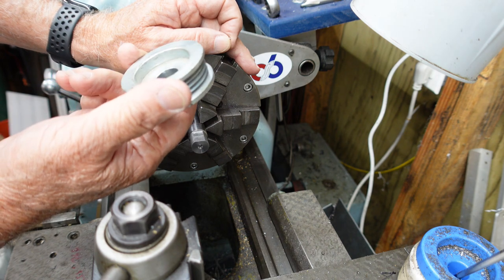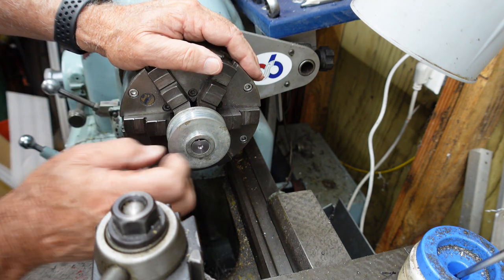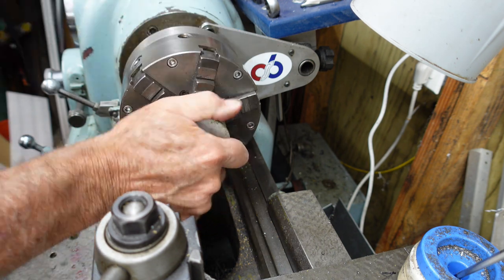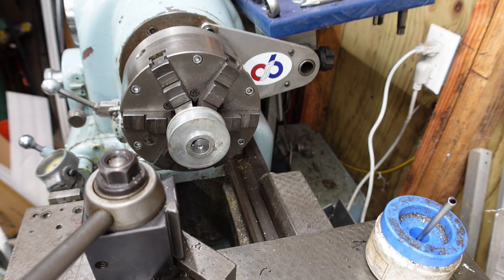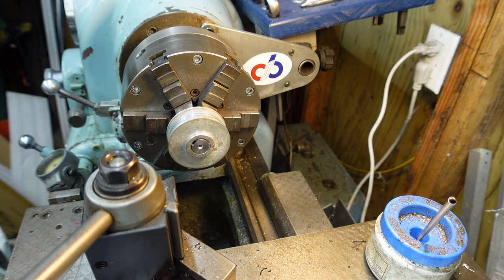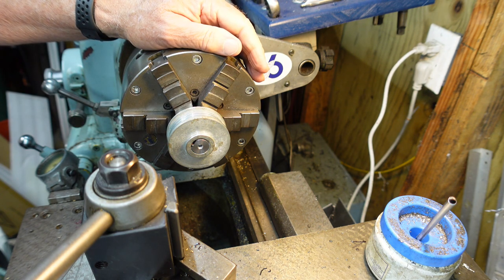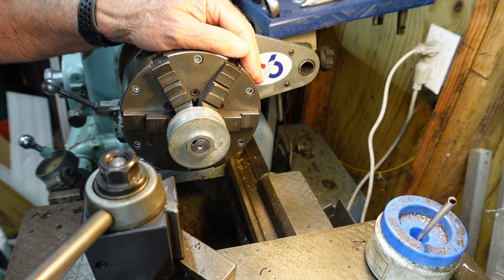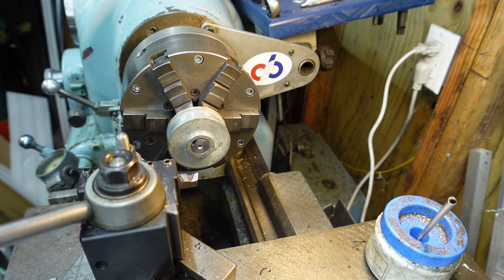Let's try turning this and see how well it locks. Pin's back in — just a slight turn and the unit's locked. I'm going to turn on the old Monarch here — it's a motor-generator unit so it's a loud unit. This material is steel; magnets are sticking to it. I don't know how hard it is — that'll be interesting to find out. Let's try some high-speed steel first.